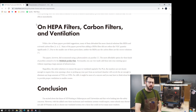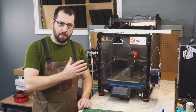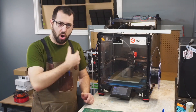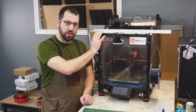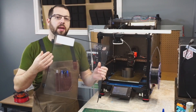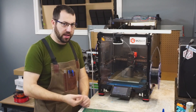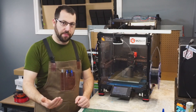The article does spend some time talking about filtration systems you can use, so I'm going to quickly go over the setups that I use on my two Voron V2s for printing ABS. Both printers I use for printing ABS are fully enclosed, non-ventilated, with solid side panels on all sides. What I have done is run a gasket around all the panels so that when I am printing ABS, the gasket helps keep the heat in and prevents the fumes and VOCs from escaping the printer.